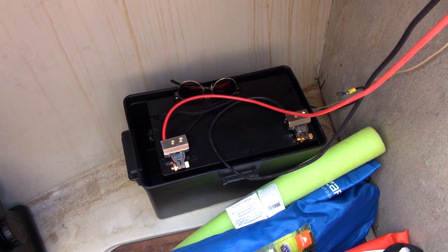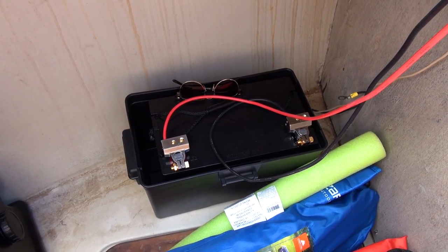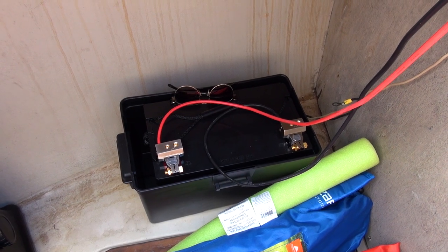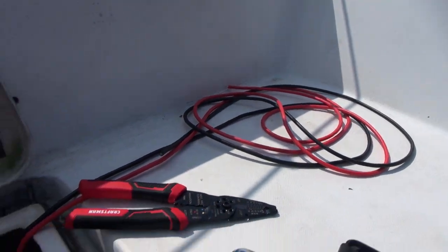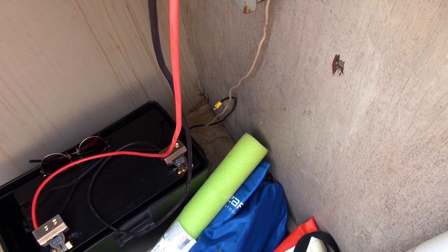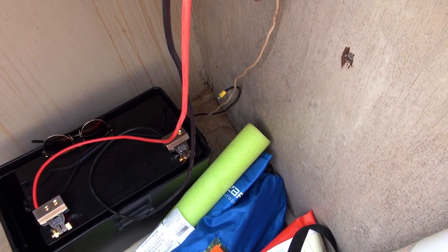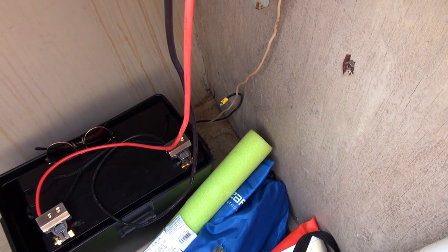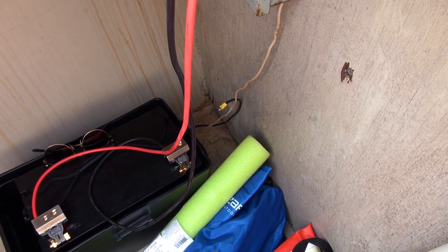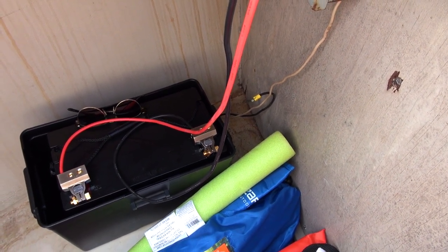We are now on day number three and I have the whole day, so hopefully I'll be able to get a decent amount done. I've already gone ahead and wired in the 10 gauge wire directly into the battery terminals - I just have it funneled up right here, but I'm going to run it down where the old battery cables were, further into the boat. I've decided to actually mount the fuse panel on the interior of the boat so I don't have to run many many feet back and forth of cabling - one for each circuit, which would be 12 total.